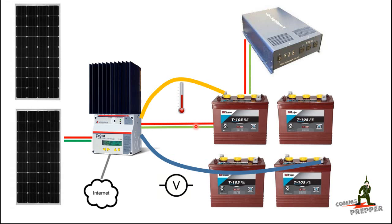The charge controller will then increase that voltage just a little bit to compensate for the drop in the line. What's impacting my system — my oversight — is the temperature compensation line. My batteries are flooded lead acid batteries, which produce hydrogen gas, so I had to install them in a battery box located outside so that hydrogen gas could safely vent into the atmosphere. This creates a temperature difference between the charge controller, installed inside the retreat, and the batteries outside under the deck.